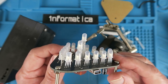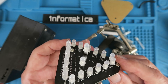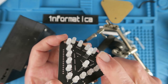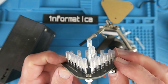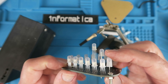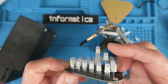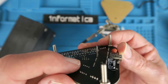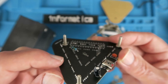With the outermost ring of LEDs installed at 15 millimeters height, we then have nine LEDs on the inner ring and then the final one in the centre. The heights for these: the inner ring top height is around 24 millimeters, and then the final centre one at 32 millimeters. The 32 millimeters gives us just enough of the pins to solder to. Let's get that done.